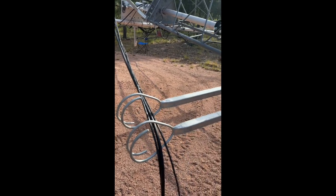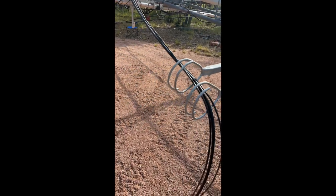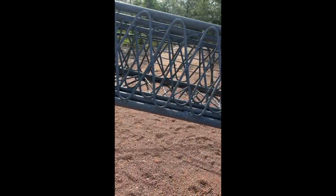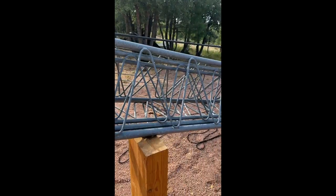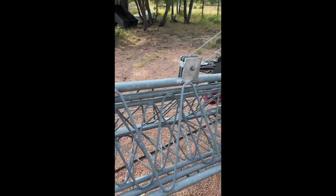It's funny — the wire antennas don't seem to affect the beam at all when it's all in operation, but the beam affects the wires. I have to retract the whole beam and then the wires resonate where they're supposed to.